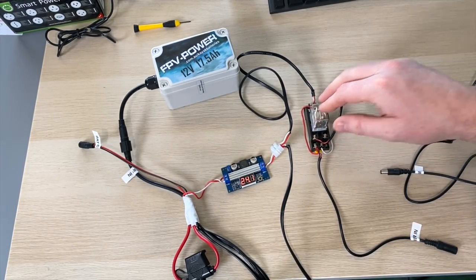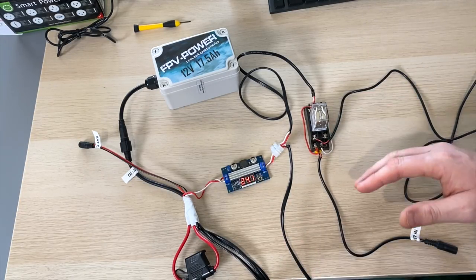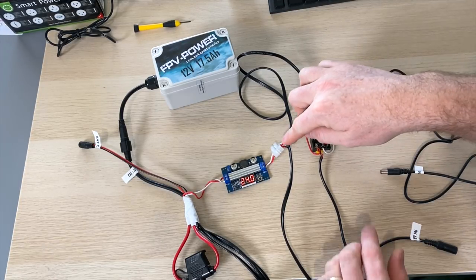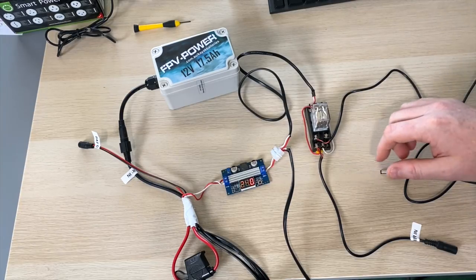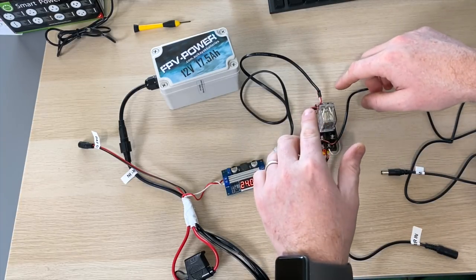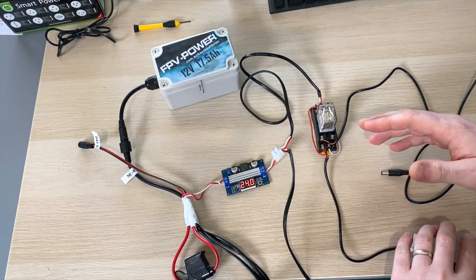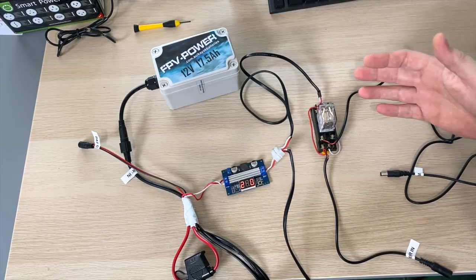It is a Maxspect Jump skimmer, but it would work with any other DC powered skimmer. In this instance, it's a 24 volt DC skimmer. So I've also tapped into the 24 volts out from my little DC to DC converter here. And what I have here is this double pole, double throw relay. Now what that means is it has two completely separate sides, and it has two different options coming into it. One of those options is selected when there is power supplied to it, and the other one is selected when there is not power supplied to it.